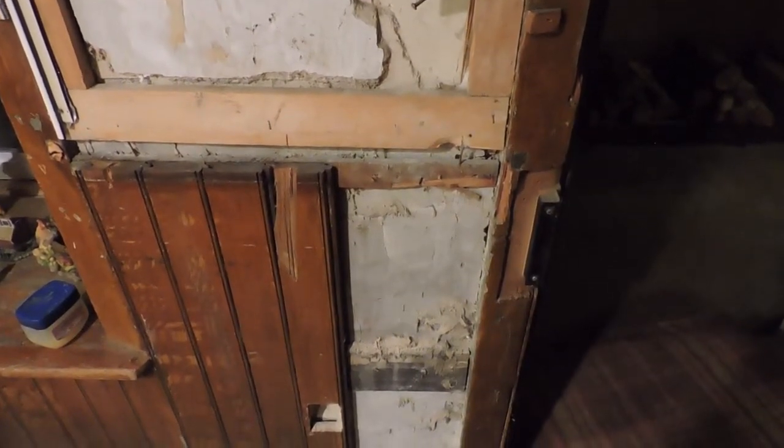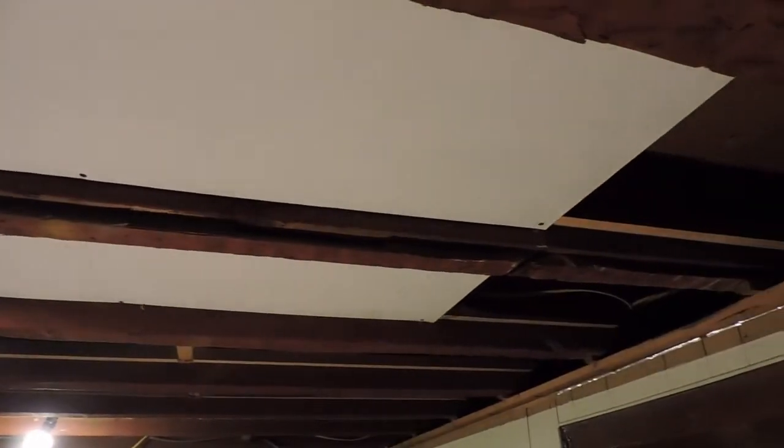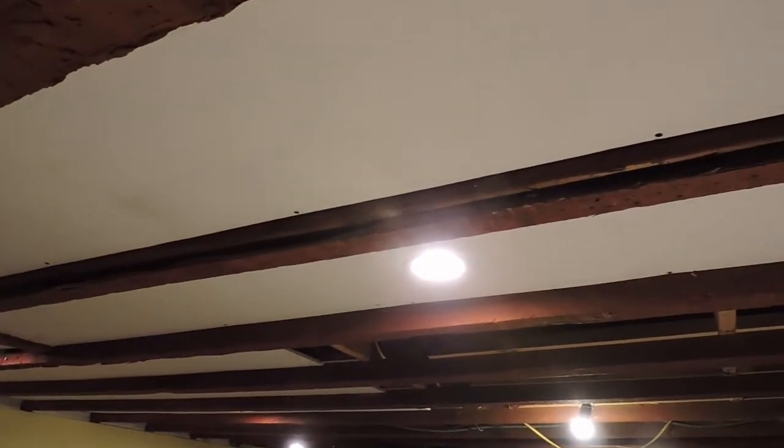I'm trying to finish off the ceiling in here. As you can see, it's got beamwork and some drywall and some lights and a lot of wires, and I can't finish off the drywall for the ceiling. The plan is to have exposed beamwork with drywall in between, but I can't put all the drywall up until I run all my electric wires, because obviously I'm not getting up there again. I have to run a lot of my wiring for the rest of the house, since I'm bypassing all the old and putting all new wiring in through here. This is a basement living room, and the main panel box is a ways away, so I have to run everything through here.